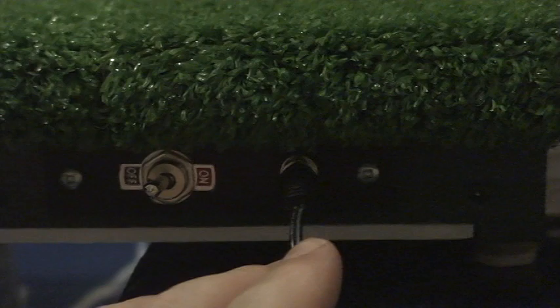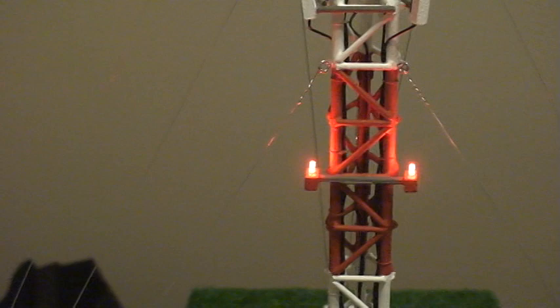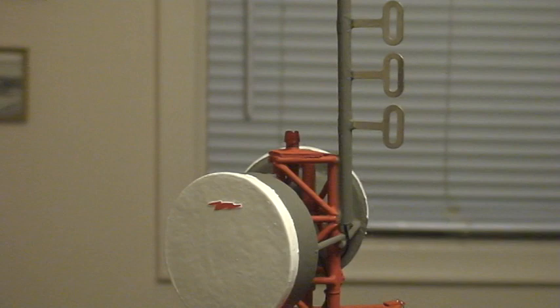Down here is where the machine gets powered up. There's a switch and it's fed by 12 volt DC current through a power supply that you just plug into your 120 volt AC current. When you turn this on — like so — now you see the lights come on. The clicking noise you hear is the sound of the relay clicking the lights off and on.